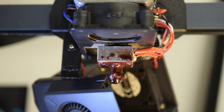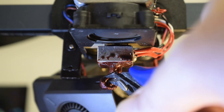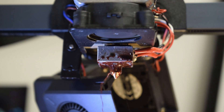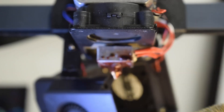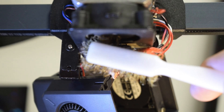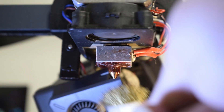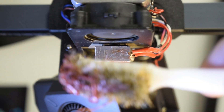We have it up to 180 degrees Celsius. First thing I'm going to do, I'm going to take my old side cutters. Look at that — it's already moving right off. See? Big old blob of it. There's the nozzle underneath it. Please be careful, because this is extremely hot. Now we're going to take the brush — a little close there — and just try to brush it off of everything. It looks like I'm tearing off old strawberry jam.